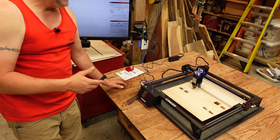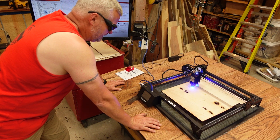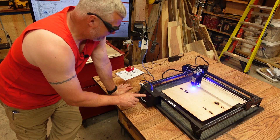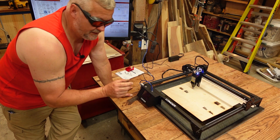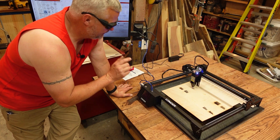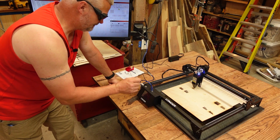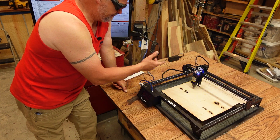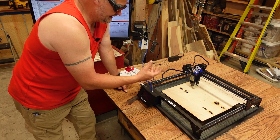The one thing that I think this machine really shines at is the focal point — it is very, very small. I know 10 watts, that's traditionally what they're known for, but this machine has an alignment tool that you use to position it. You can hit the button and it'll turn the light on so you can aim it. If you focus the machine just right, even at 3% it'll mark this wood. If you drop the focus down a little bit lower than what they recommend, it will actually bring that focal point to where it will leave a small mark. The machine does not come with an air assist, but it has a cone that basically allows the air passing through the module to be brought to a pretty decent little point and create a little bit of pressure to kind of serve as an air assist.